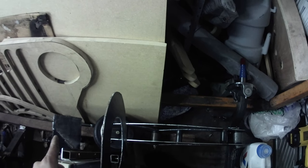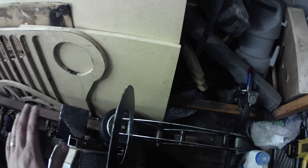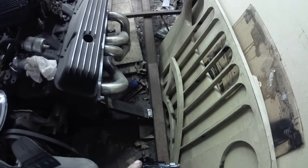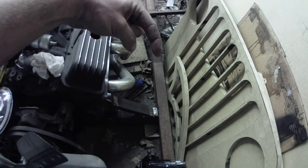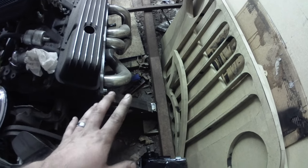And with the Vega box, I should still get less of the squirreliness that you usually get out of the Ford truck boxes, which is why I wanted to run the Vega steering. And also, that's going to make my steering angles better, because as you can see, the firewall would be right about there somewhere, and then the steering shaft from the steering column would be right here. So I'll have a short shaft and then a universal joint, and that's not bad.